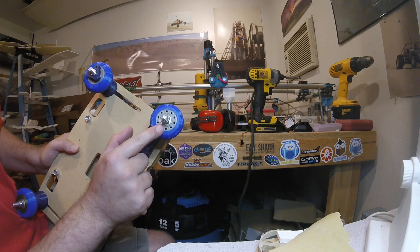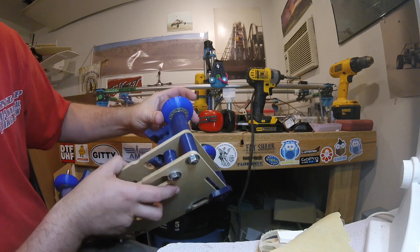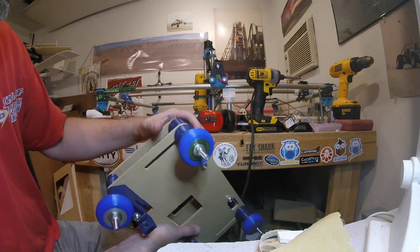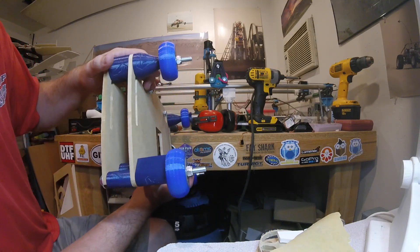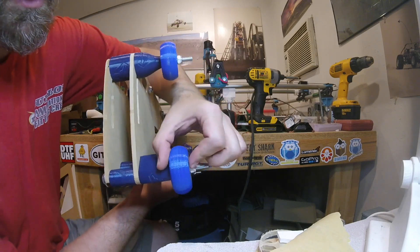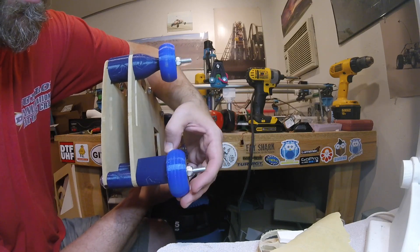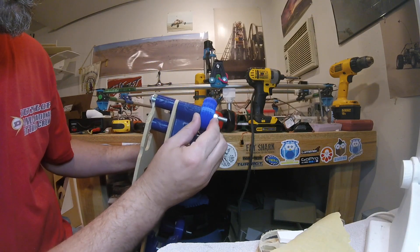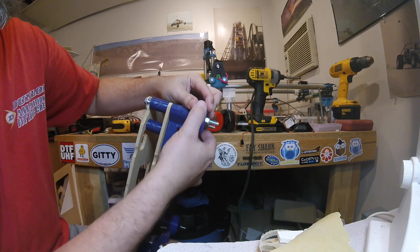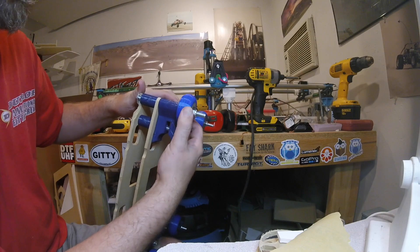You'd probably end up destroying the tire trying to pry it off. I did them with two profiles: this one has a flatter face so it sticks to the print bed better, with square edges and then a round curve over it. This other one has a more square profile with sharp edges and then curves over, so it's easier to print and prints more symmetrically. The rounder-edged one doesn't print quite as cleanly but is still totally usable. I'm printing the TPU tires with six perimeters so they're very stiff, and the center section is basically solid TPU riding on the PLA.